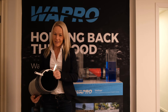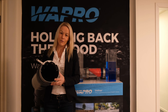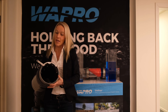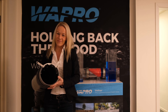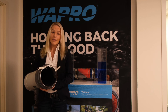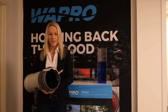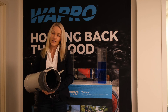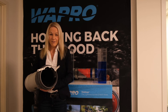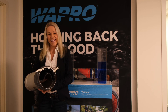Because it's completely sealed against backflow, it's also really good for odor applications. If you're trying to stop odor transmitting through your system such as a sewer system, this is the perfect product for that. We manufacture the Wastop inline check valve from 75 millimetres in diameter — 3 inches — up to 1.8 metres in diameter, or 72 inches, with larger sizes available on demand.